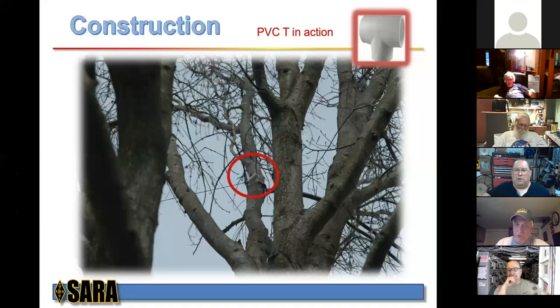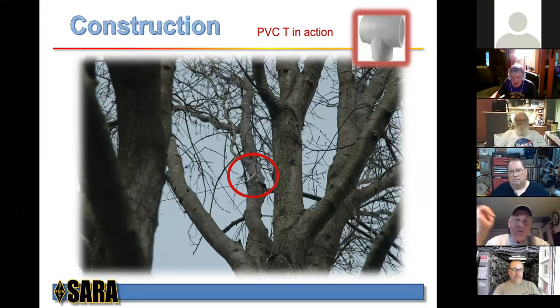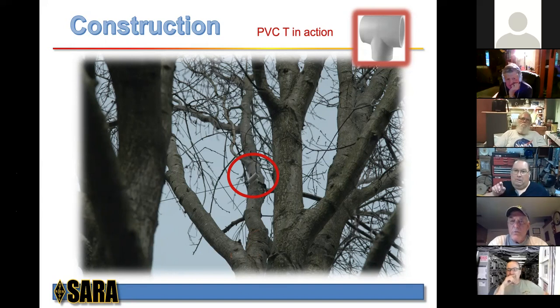So quick question, Gary. Sure. Does foliage affect the SWR or rain? It will, yeah. And George, you've had more experience with it. The LDG tuner that I use has memory. So when it's wet out or raining, I'll notice that the SWR goes up a little bit at the memory component. So I do retune at that point, and the tuner takes care of all of that stuff. My assumption is that it definitely affects the SWR. George, you want to comment on the performance aspect of it, or whatever else you want to say?